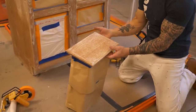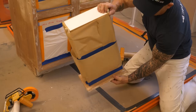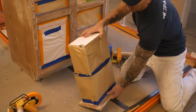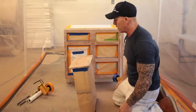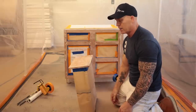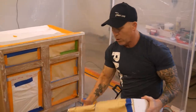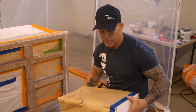If you were spraying the backsides of these doors, you would flip it over and spray the backside first, let that set up, then flip it over and spray the top and the front — and you're not going to get any overspray. That's what it looks like for spraying drawers and boxes when the fronts don't come off.